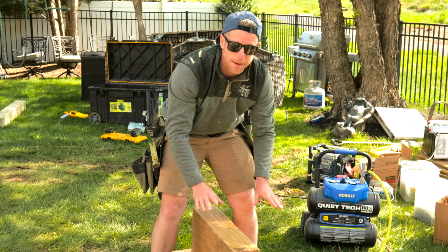All of the load from this roof is happening up at our ridge beam and on our side beams. This beam across the front is oversized like this so that we can hanger it, and it's gonna take a little bit of the load off of that cantilever. A little complicated. Hopefully the architect knows what he's talking about, because that post is coming out whether the roof comes down or not. I don't care, it's coming out. Let's see.